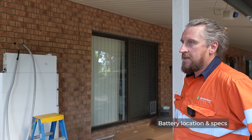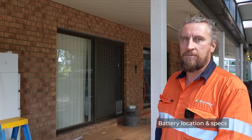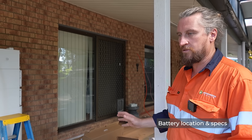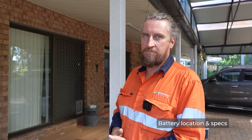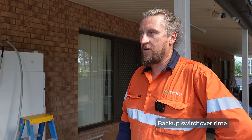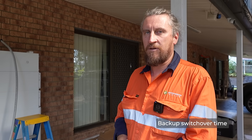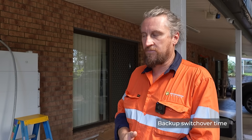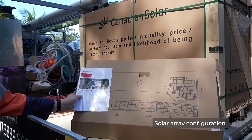On the other side we've got an AC charger going in as well, just so this customer can have multiple cars charging at similar times. We've got to make sure they all talk to each other — there'll be interconnection data to make sure we don't overload the mains coming in without too much power getting charged to the cars. The distance here is all within parameters, something we checked before starting construction to make sure the distance between the gateway and the inverter is within the required time — so how quickly it disconnects from the grid, how much power is getting fed back and forth, and how far the cables are.